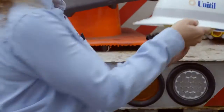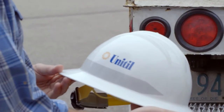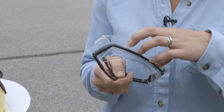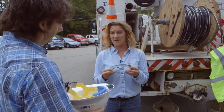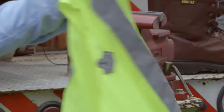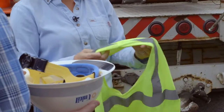What are the first things you need to do if we're going to go out on the site? The first thing we need is a hard hat — it protects your head from any overhead falling objects. Second thing, safety glasses. These are shatter resistant and they have side shields that protect your eyes if anything were to come in from the side, so you need to have these on at all times on site. We also want to make sure that you're visible to people on site, passers-by, and people driving by — high visibility reflective material.